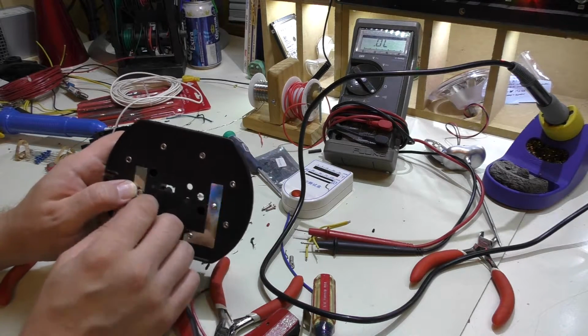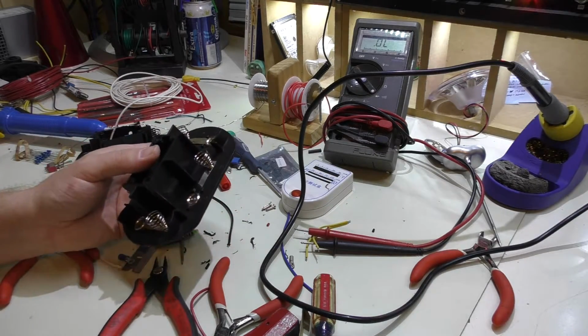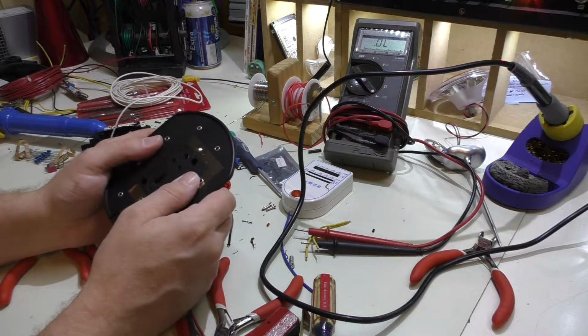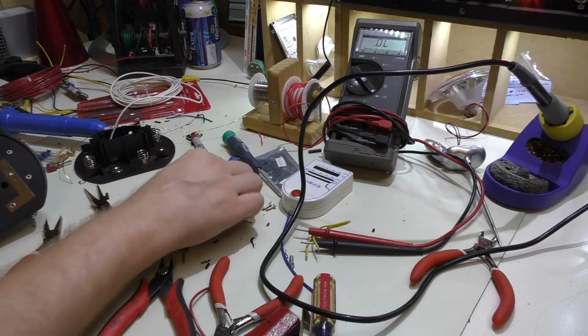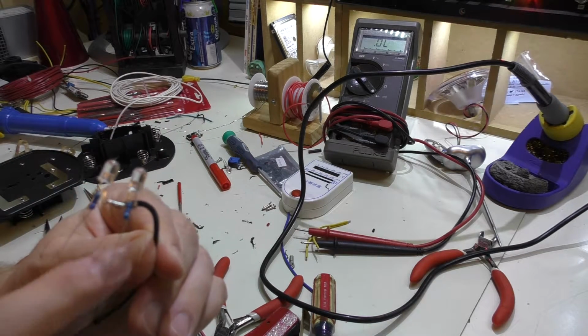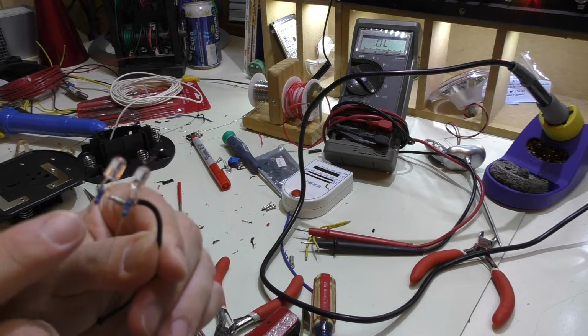I mean, it'll be ugly in a way, but it might enhance the look in another, because you know, it's going to give it more of an industrial look, I guess you could say. But I did also make the LEDs. Now you can see the middle here, it's bridged, that's the negative, and then you have 2 positives over here with the resistor at each end.